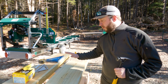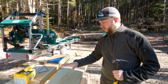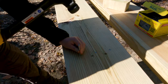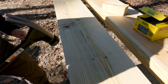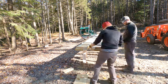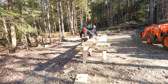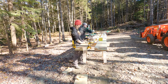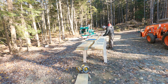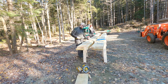We went down with the tape, speed square, and pencil and put in a load of layout lines — markings for where the joist hangers and joists will go, and also for the nails we're going to use to join the two 2x12s together. First we'll join them together and then nail in the joist hangers. Once all measurements were lined up and marked, we started nailing the skids together using clamps to make sure they were held tightly. We also put nails in staggered from both sides to make a really strong connection. Once joined, we added the joist hangers using special hanger nails, going down one side first and making sure everything was perfectly lined up using a scrap of wood.